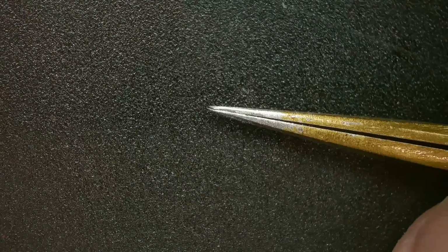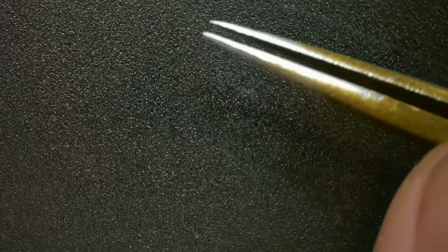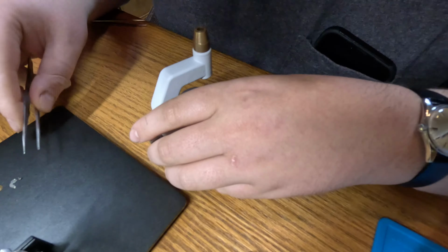What I was saying about the pivots causing amplitude drop when it's on its side is that whenever you rotate the watch to its side, it didn't affect timekeeping that much, but the amplitude drops. So if the pivots aren't perfectly polished, it will cause more friction whenever the watch is on its side, and it'll cause amplitude to drop.